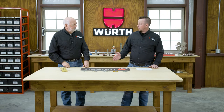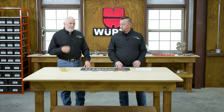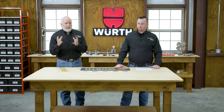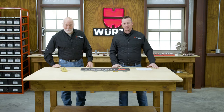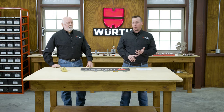Yeah. Let's start with the basics of a blind rivet. Okay. What I like to start with is always materials and finishes. So when we start talking about rivets, you typically see them in steel. Yes. Okay, and with finishes on steel, really there's only one option, which is zinc plating. And the reason for that is your finish on your steel has to be ductile because you're going to upset this rivet and the finish has to be able to give with that. So not every finish will work on a blind rivet. So zinc is primarily the one that's used. Yeah, we're not going to see zinc flake on there because obviously it becomes brittle, right? Those are things that we can't do. And you're not going to hot dip galvanize them either. Don't do that. Yeah. Probably destroy the rivet at that point. Yeah, exactly. So, aluminum is another one we see a lot of. Very popular. Stainless. And even copper.